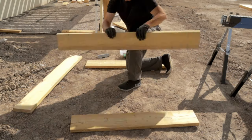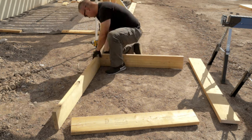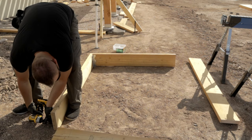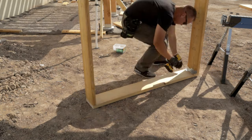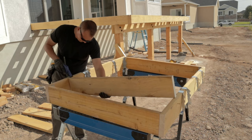I start by building out the frame of the deck. The platform itself is four feet by five feet, but the walking space is actually four feet by four feet. That extra foot is where the step from the upper deck will rest — as we get farther along in the build it will make more sense.